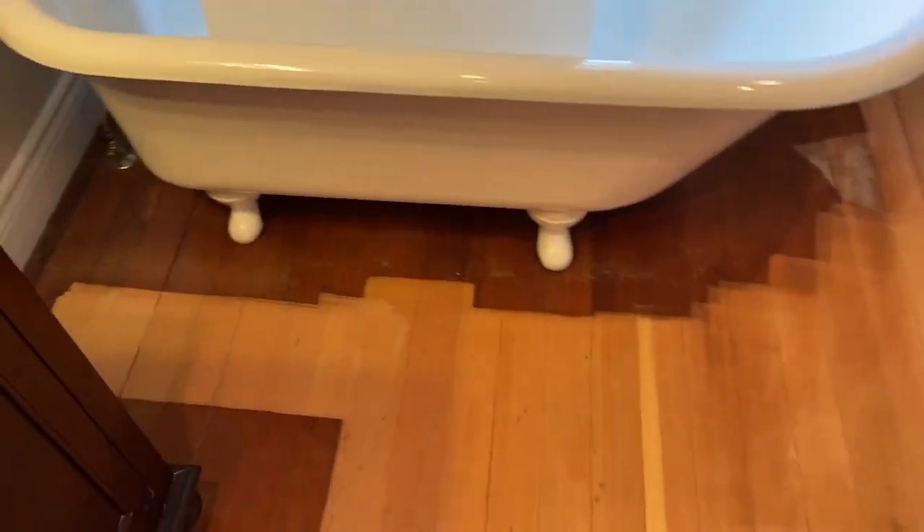Because if it works, you can sand your entire floor with 60 grit. So this is what we've done so far with one new 60 grit sheet. As you can see, before you hit it with 24, 36 or 40 grit, start off with a 60.